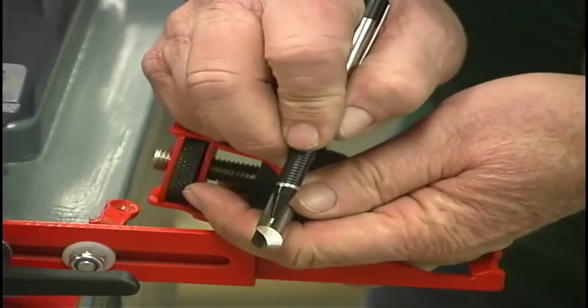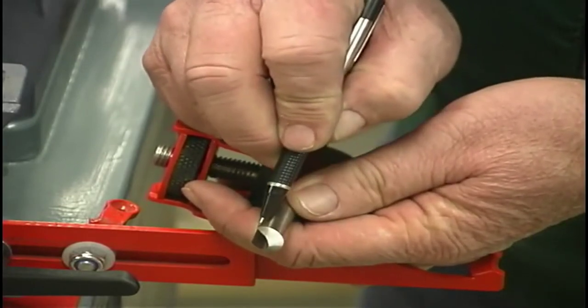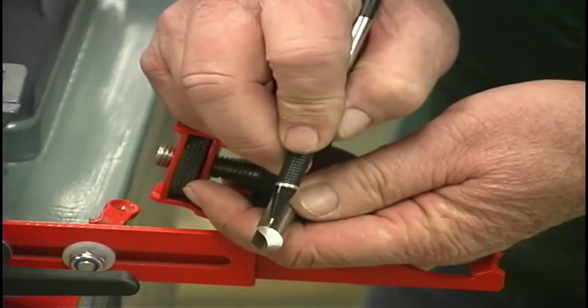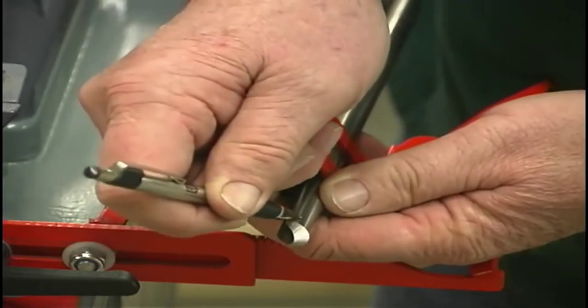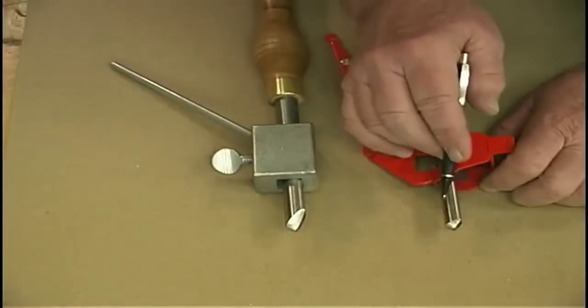That jig will produce a very nice grind. As you notice, I have no cheek — everything just blends up into an even line at the end of the ear. This makes this area much stronger rather than carrying this width all the way over, which is what I mean by a cheek. Here's our finished grind.